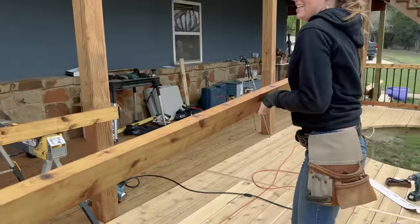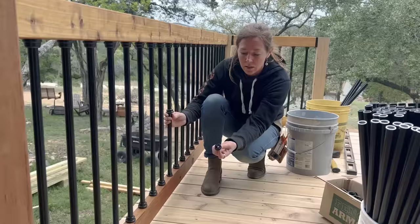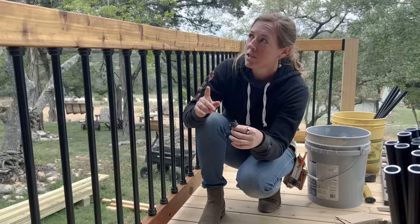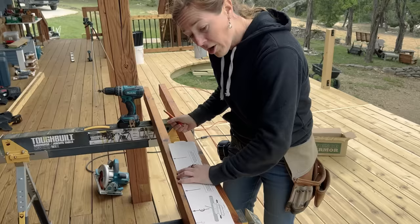I'm going to move the rails out to the sawhorses. The first thing to do is put in these base shoes that will receive the balusters. To do this I'm first going to do the layout for all of these screws and then screw them all down. Code states that you can't have a larger than four-inch gap, so these are all spaced to be less than four inches. Part of the box actually includes the orange layout you need, so I'm just going to find center on both and mark where these are evenly spaced with a pencil.